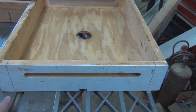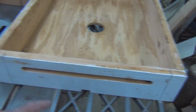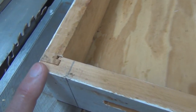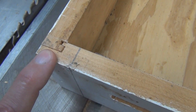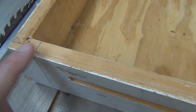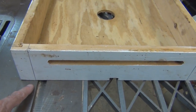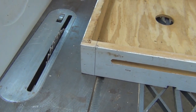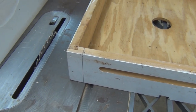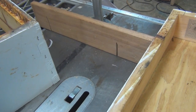I just need to cut this down. I was thinking I'd initially just cut one side, but after measuring I want it all centered — I need to take off one and a quarter inches off each side. I was going to use a fence on the table saw, but it's too narrow to slide along the fence stably, so I'm going to bolt it onto the sled.